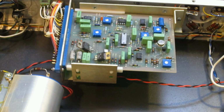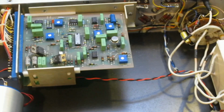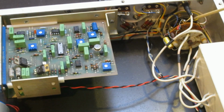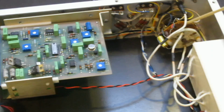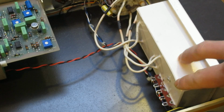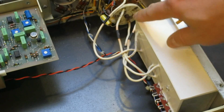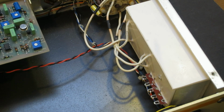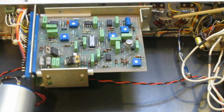But anyway, so then we have these two transistors here, and the polarity switching switches right here. And this unit, that's actually pretty soft. So anyway, inside here, that's the potted DC to DC converter. So now, as I mentioned earlier, one of the possible failure modes is that these two transistors are blown.